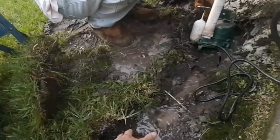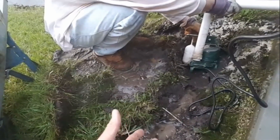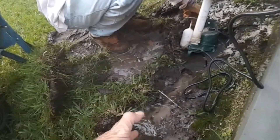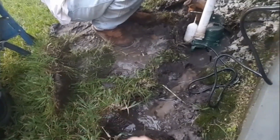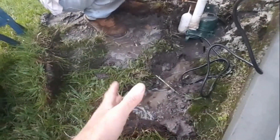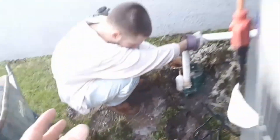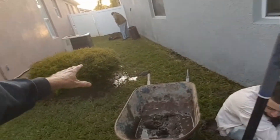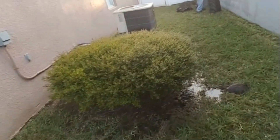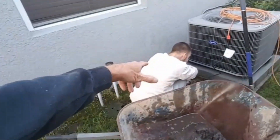You can just see this water flowing — it's really flooded back here. You think that sandy soils soak up water, but here's an example of where they do not. Once the ground becomes saturated there's no place for that water to go, and because we're so deep we're going to put a sump pit in right here.